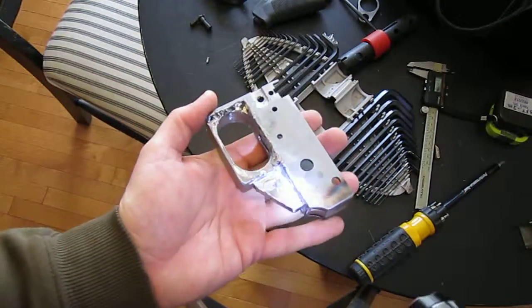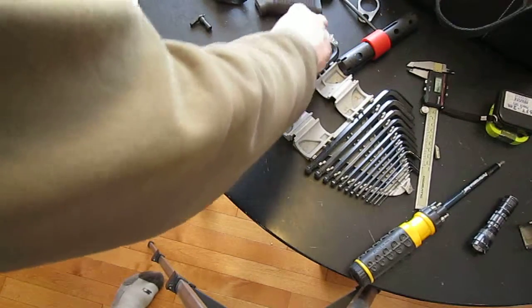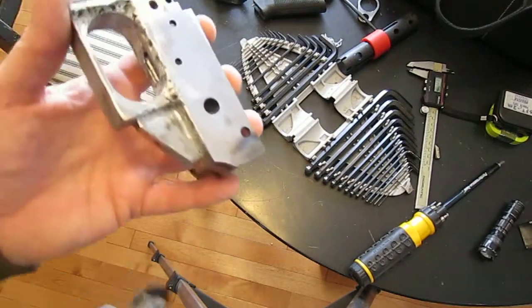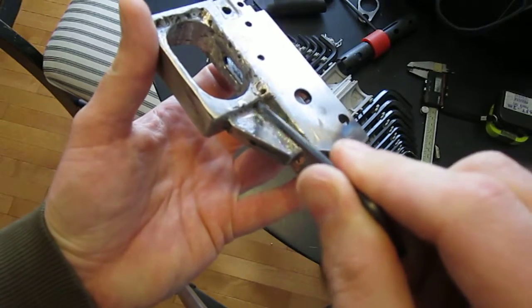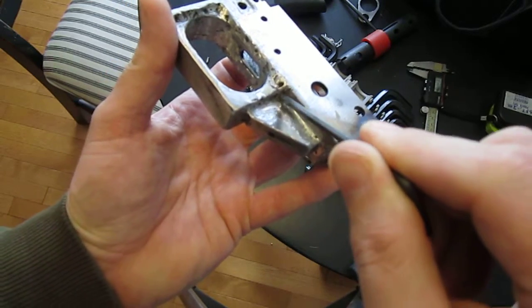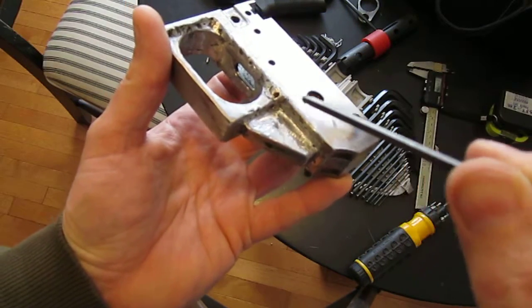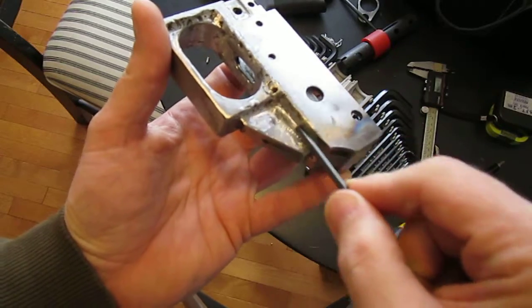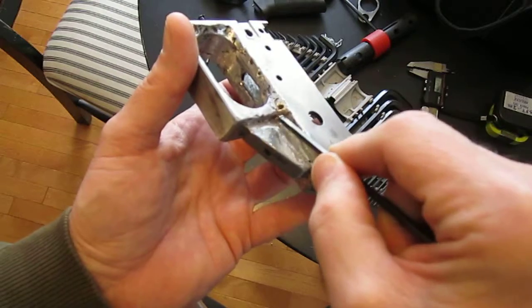Also, just a little bit of a welding tip. Give me a pointer. Do not weld in this area right here. It is a nightmare to try and grind the material back out if you can't reach it with a Dremel with a cutoff wheel. You can cut here, you can cut here, here. You can grind away the surfaces, you just cannot get into that freaking corner.